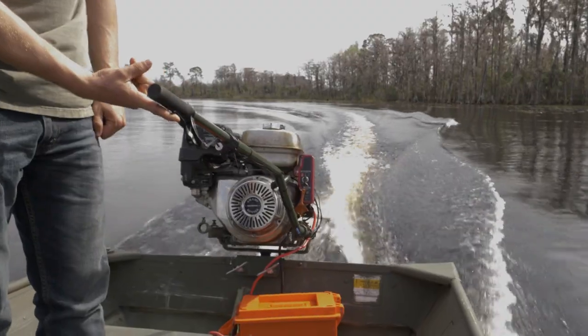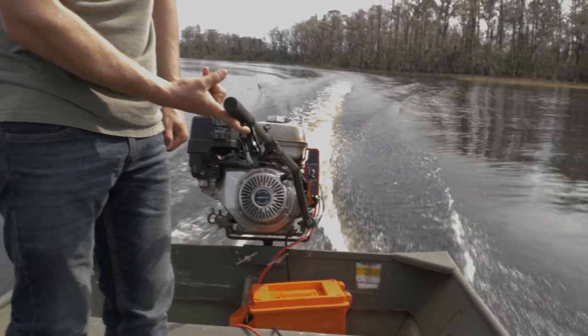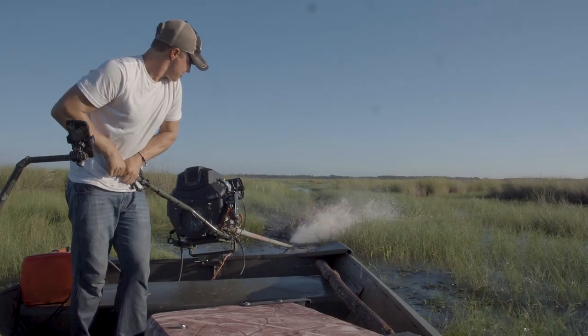Once you get it centered it really should calm down and it should want to drive pretty much right on its own. Make small adjustments — go back out, give it a test drive, see where it sits. You want to do it until it just sits perfectly centered in the wake and you're able to drive it pretty simply. It is going to take quite a bit of force to actually get the skeg to bend, but you're not going to break it. Once you get it to where you need it, leave it alone — it shouldn't ever come off that angle. This is thick metal; I've dug my longtail into the ground and moved my whole boat around and that little curve I put on the end pretty much holds true no matter what.